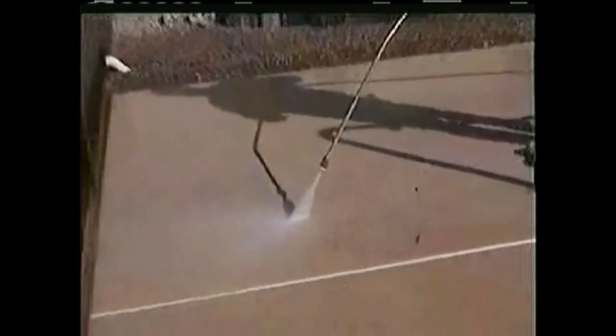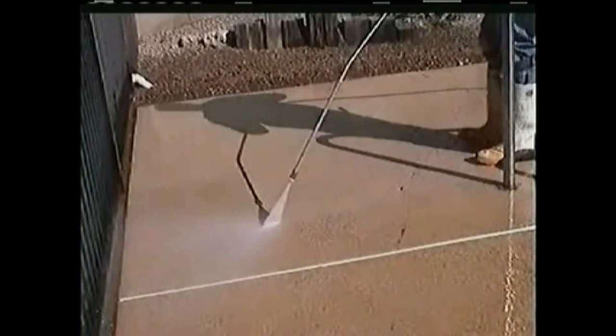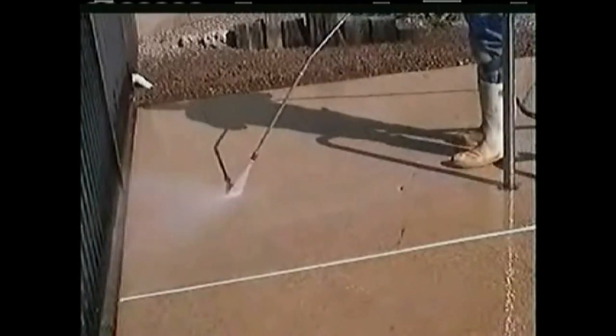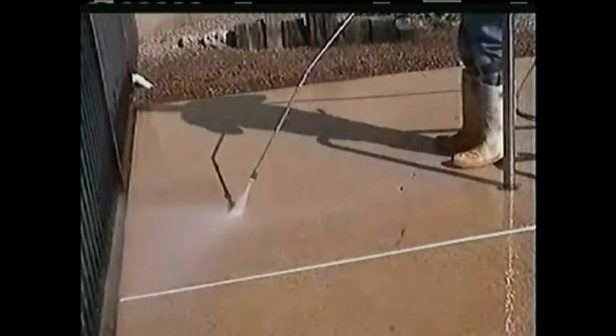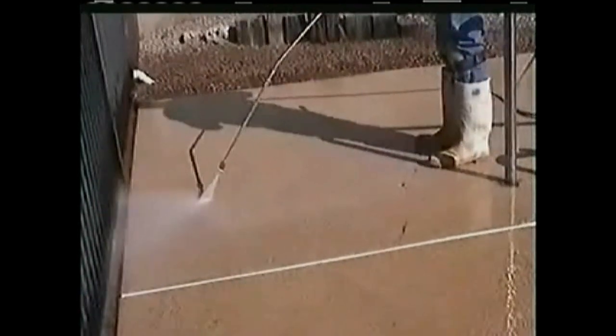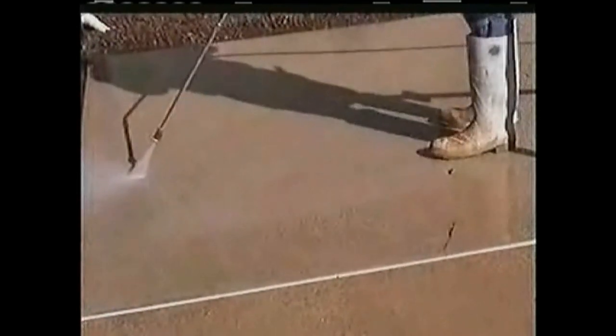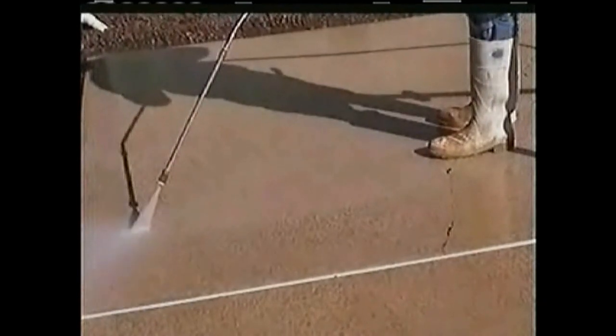Surfaces that are already painted or have any oil contamination need to be cleaned using TSP — trisodium phosphate. Mix approximately 1 cup TSP to 4 gallons of water. Allow 3 minutes to dissolve, stir, and apply the solution to the surface like you did the muriatic acid. Scrub strongly with a stiff bristle broom, then after waiting 5 to 10 minutes, rinse and scrub thoroughly at the same time, removing any trace of residue.